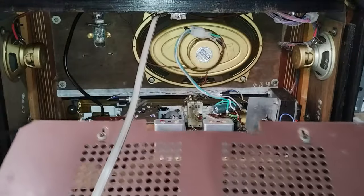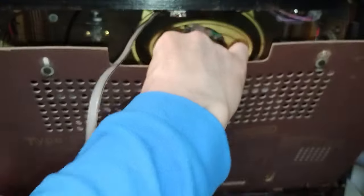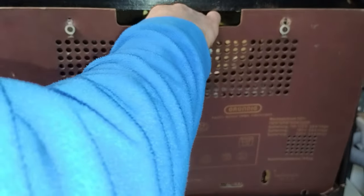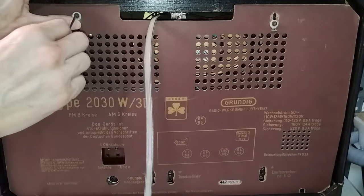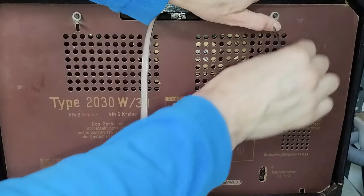It is not shown in these clips, but obviously, the chassis was fixed to the bottom of the cabinet with four screws. If the grommet spacers are relatively soft, the tightness of the screws should be adapted so that the tone control knobs could be operated correctly without brushing the cabinet.